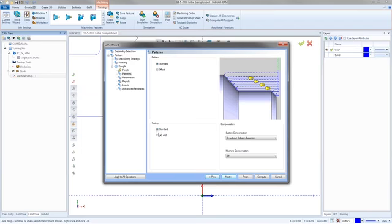Now for the sorting, you either do it as a standard, so from front face to back, or you can do a zigzag. And with this one, it's a lot more back dragging on the insert, so there could be holder collisions. There are going to be so many things that don't work with this one. I don't use it too often. In special scenarios, I get some guys that do a lot of turning with basically a grooving tool, and that zigzag does a great job with some of those tools. So definitely something to play around with, see if it's going to be a benefit to you.